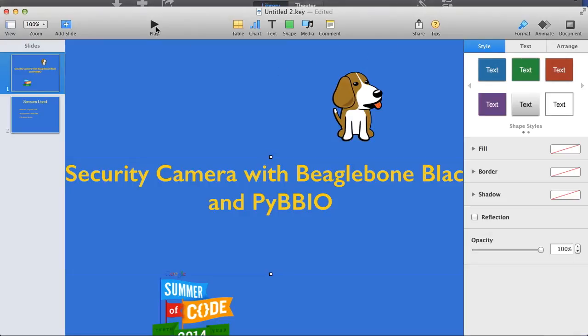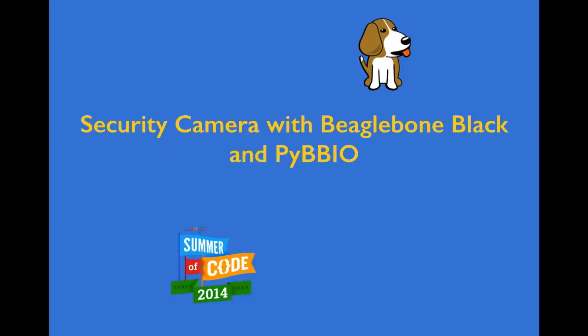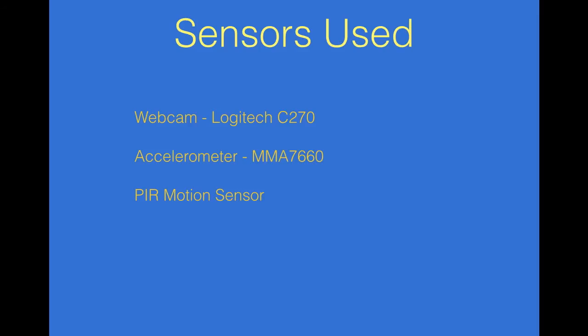In this video, I am going to demonstrate how to make a security camera application using the Beaglebone Black and the PyBBIO library. The camera takes a picture if it detects a movement or if the camera is being tampered with. Motion is detected using a PIR motion sensor, and the accelerometer is used for shake detection to determine if the camera is being tampered with.